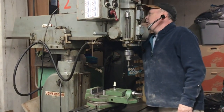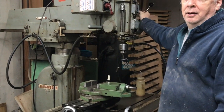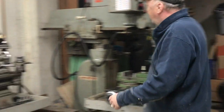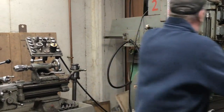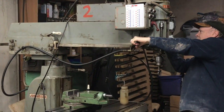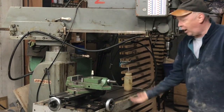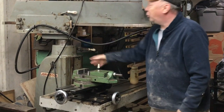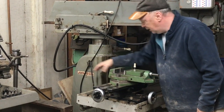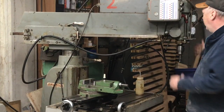And this is a radial drill press. And when you finally get to see 1800 open, there's a radial drill press there in the wood shop. So if I release all the latches, I can pull this in and out, and I can spin it around. So I can drill holes anywhere that I can reach with this. This table cranks up and down. I can actually crank the post up and down to raise this up. And in the back there, underneath the pile of crap, is another table like this, that's this high. So I could bolt something to that and drill holes in it.